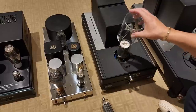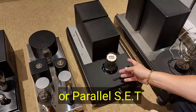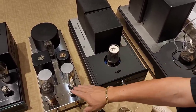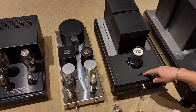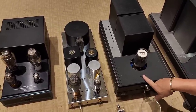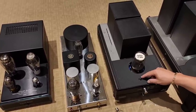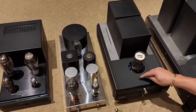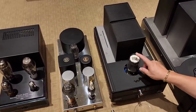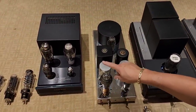You always know a single-ended triode when it has a single power tube — just one. If it has two, it's push-pull. The most pure approach is just one output tube. Even though this amp has several tubes visible, one of those is the driver for the power tube. This one appears to have a transistor driver. It always needs something to give the signal a first bump — the signal is really small and needs a first stage to bring it up to the level the power tube can handle. It's like a kickstarter for the main tube. Over there, the 6SN7 is the kickstart for the 300B.